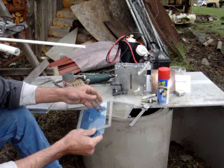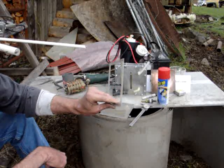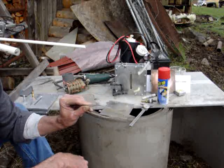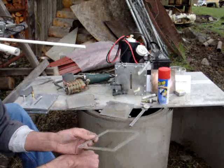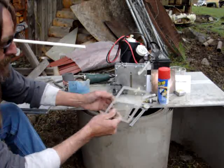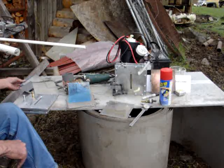I've also been doing a lot of experimenting with different gasket materials. Plexiglass, this is 1/8 of an inch. I think that it's a little bit too thick, too wide. It puts too much distance between the plates. But if you're running the correct electrolytes and forcing amperage in, works pretty good. You spray this with Plasti Dip, and it makes an excellent gasket.